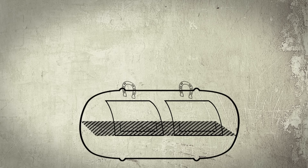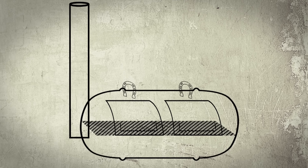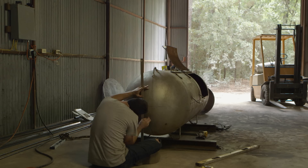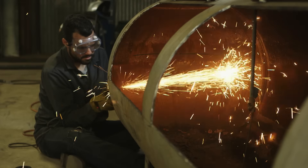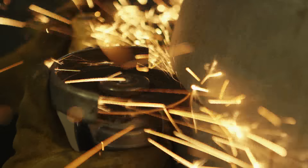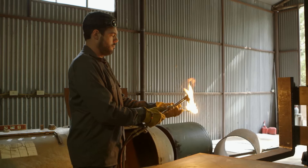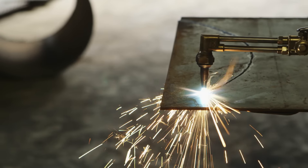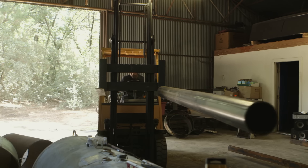Now it's time to work on the smokestack. Some people may want to put the smokestack on top or on bottom, but if you're trying to get the most airflow and heat across the grates, I think the best spot is right in the middle. I'd like to find where the grate is, make a level mark, cut the hole in the cook chamber, and make sort of a collector to come out — that way it pulls the heat and air across the grates a little bit better.